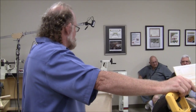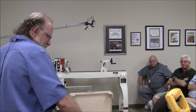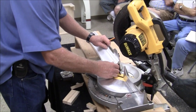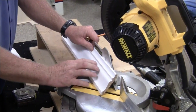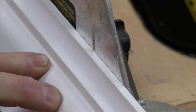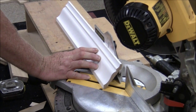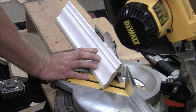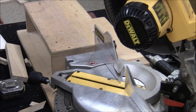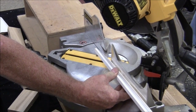You cut on the angle, not with the crown flat on it. That's what I call being in bed — that's why I was just getting ready to cut this. With crown, you cut it on the box upside down, bed it against the fence and on the table. You'd rather do that than put a tilt on the blade — unless you have a compound miter saw, you can't do that. Nowadays most everybody's got a sliding compound in the shop, but when I started cutting crown they didn't exist. So you cut all your crown upside down. Unless it's something that doesn't fit on the box — another way is you can bed it like this, set it in the box with the back there and come through it.